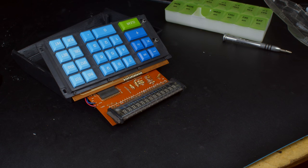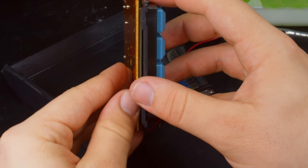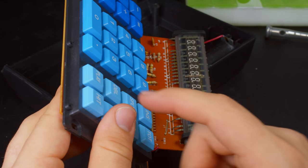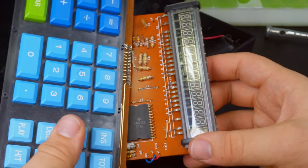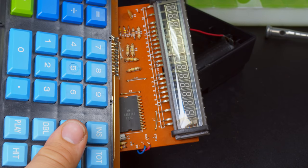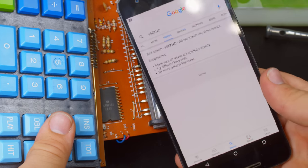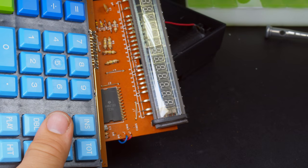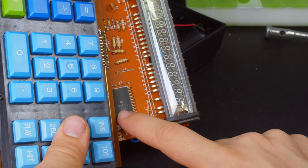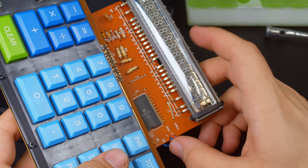Man, this thing is really confusingly assembled. It turned out removing the keypad board wasn't necessary, although we will still, because there's some interesting stuff going on in there, and I'm curious what the key switches are. But anyway, we can get in here, we can see the main IC here, and there's just one, so that does both the calculator function and the blackjack function, and I can find nothing about that. But we can see that it is from the 33rd week of 1977, so this is probably an original production run example